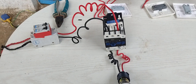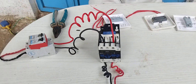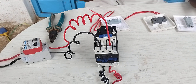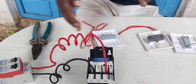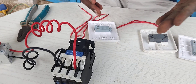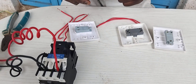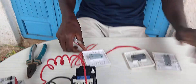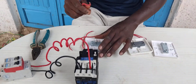Let us come now to our switches — the circuit control, I call it. Remember that video: if you have several or many terminal entries to your godown, you will make sure that you have switches at each entry. If another person enters from another entry they can put on the lights. So what I'm going to do is give my switch — my one-gang two-way switch — power.